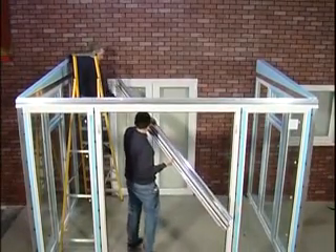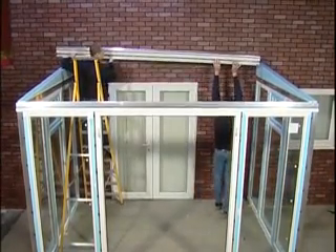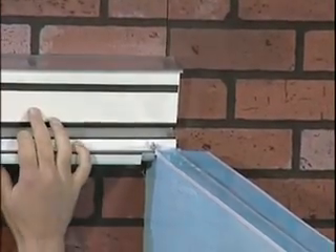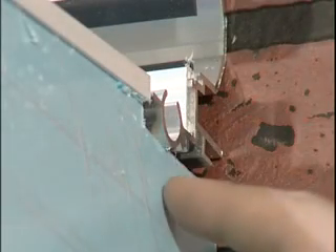Please note that the wall plate under cladding is pre-assembled and will be around 160mm shorter than the wall plate. Rest the wall plate on the rebates of the furring and position centrally. If the wall plate is in the correct position, it should overhang the furrings by 2mm at each end.